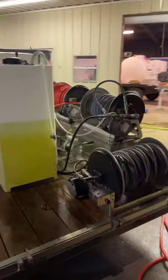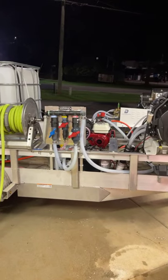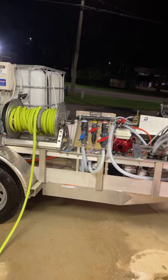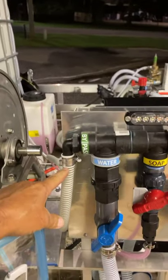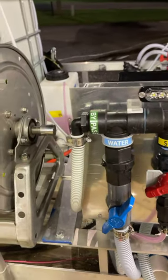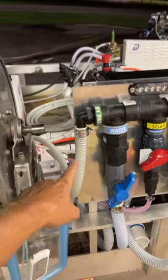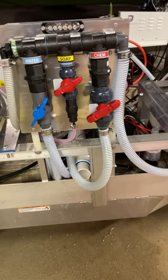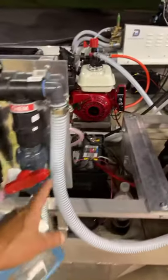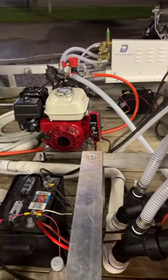You got that old air diaphragm off and that big compressor off — now it can work, now you can get something done. Adam asked whether the bypass has to be that long of a hose — most definitely. This bypass right here is what revolutionized these gas roof pumps. You definitely need 25 feet, because if you don't have 25 feet it's not going to bypass correctly and it's going to overheat. You want this ribbed hose with the reinforced PVC — I run that on everything. You don't want the old braided hose, especially on the suction hose, because it just collapses.